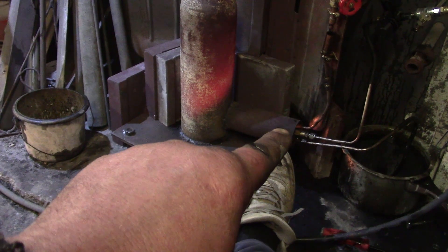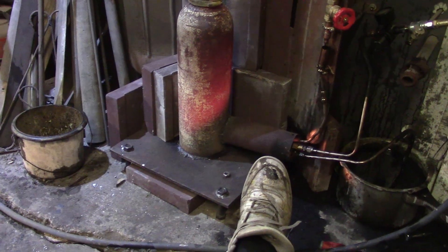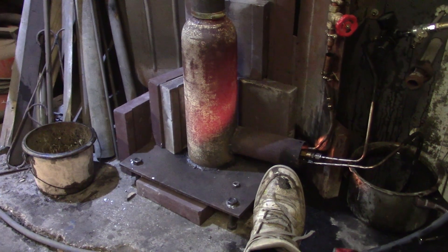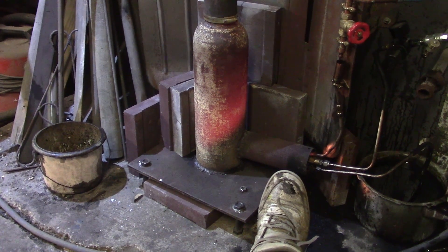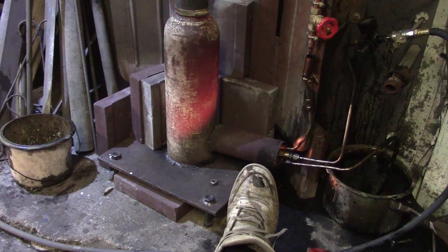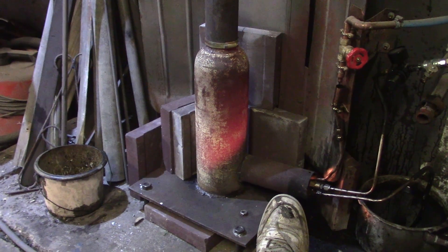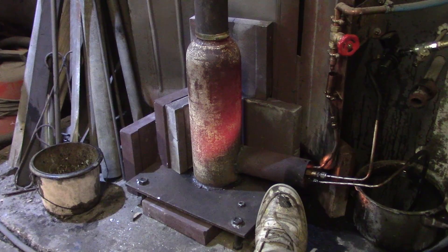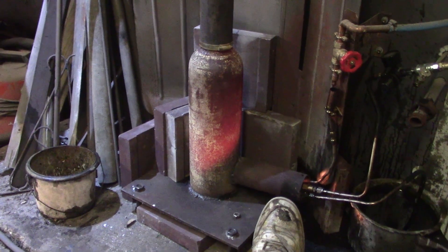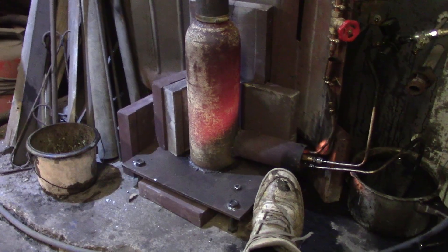That 0.8 nozzle is too small for this thing — that's why I've got the dripper in there. I think I need at least 1mm in here. After that there's a 1.2 and a 1.5, and then 2, 3, and 4mm. I do have a big 4mm one coming in from China. That's probably way too big for my foundry needs, but oil is essentially free — it just costs me time to go and get it. For a tight-arse like me it's better to spend time on fuel than hard-earned coin at the filling station. Alright, take it easy folks, see you later.